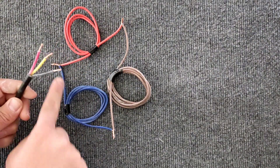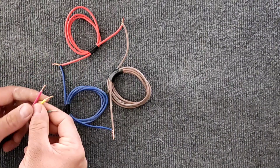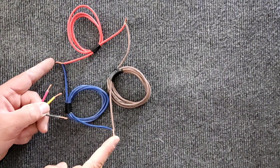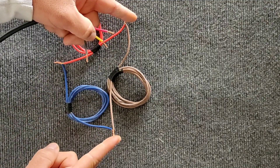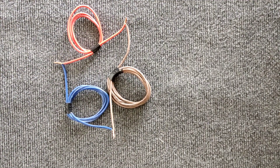The three-phase electricity is connected to these points, as you can see in the picture. In this case the voltage between the coils is equal to the three-phase electricity voltage, which is 380 volts, so the power of the motor in delta connection is more than in the star connection. If you liked the video, please press the like and subscribe button. Goodbye.